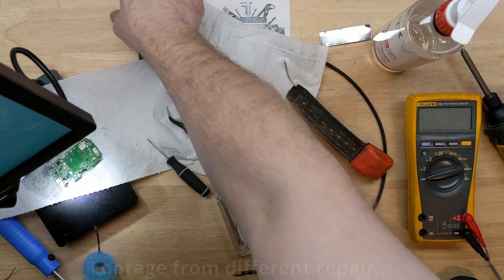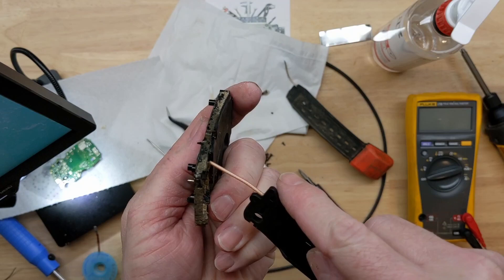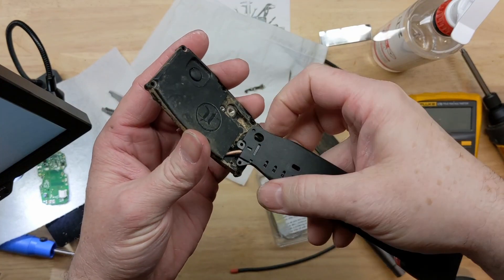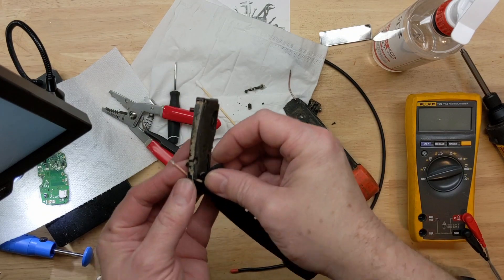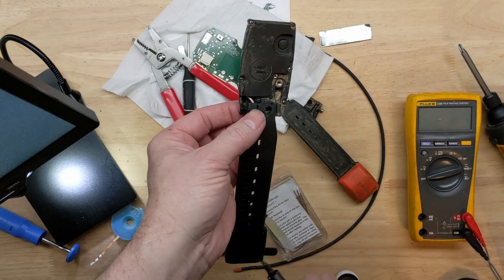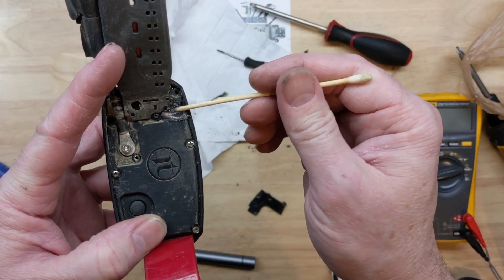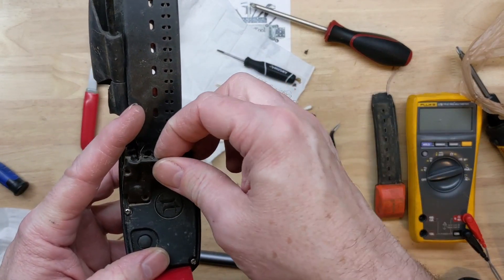The other antenna my friend had bought had a much shorter coax cable and it was not stripped — it was red with a rubber band. I pretty much had just one shot at stripping it; it wasn't long enough for more than one attempt. I was able to strip it using some very fine regular strippers, since it's very fine coax. I recommend buying the ones already stripped if you can. I did put some clear silicone sealant on the back side where the antenna coax goes into the housing before we put the cover back on.